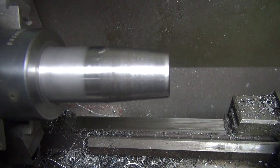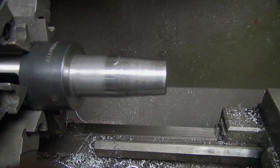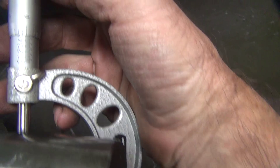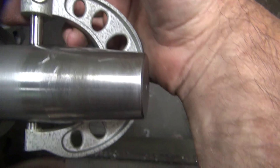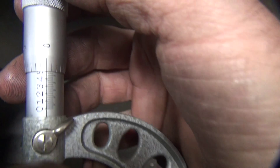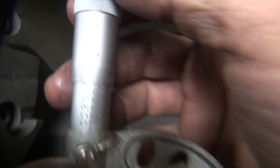Right now we're at 501 and a quarter. After the cut and re-hone, looks like we're about half a thou fat on the hard spot, a couple tenths under off the hard spot, and right on the money there. Right up on the edge we're a couple tenths under again. Pretty close — let's see if the tool holder will work.